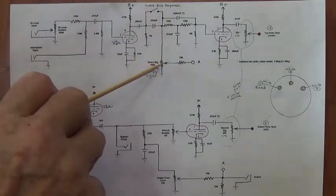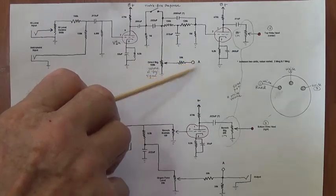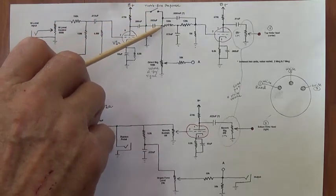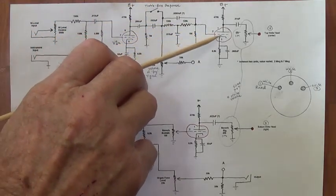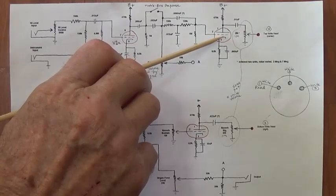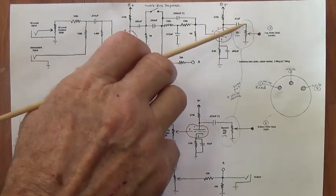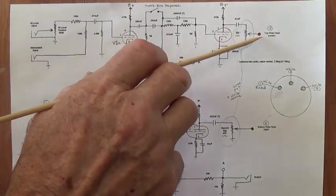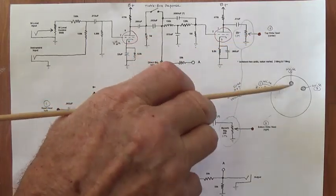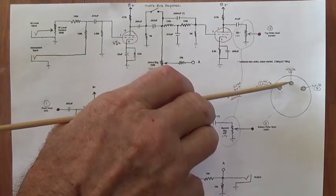Now, depending on the position of this potentiometer offering more or less resistance to that shortcut to the output, the signal may be deflected in this direction and come over to a second stage of amplification. Another triode here of a 12AX7 or 12AU7, and then it can be output to the top right head. Now, that is number two,